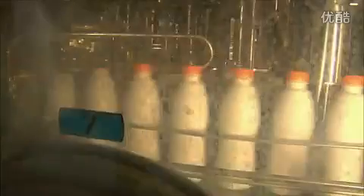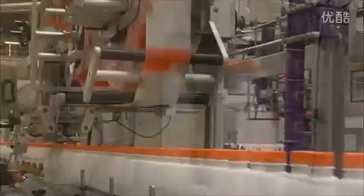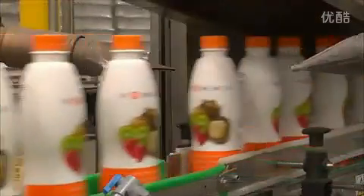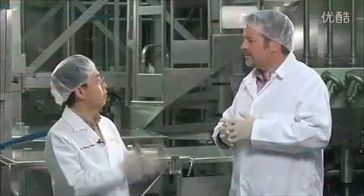The filling process is actually done in a special chamber. In the chamber, the air is sterile, bottles are sterilized, and the capsules are sterilized — the products are clean. The shrink wrapping process is pretty cool too: these white bottles with orange lids come down the line, labels are applied, and then it goes through a steam tunnel to make sure the labels are applied evenly on the bottle.